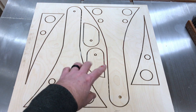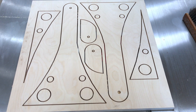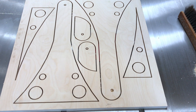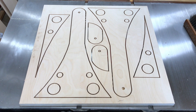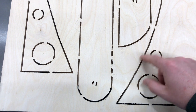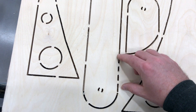I have my initial CNC cutout done. I need to flip it over and take it off, and I'm going to use the width of these pieces to precisely set my fence for the other two arms. When you use a wood CNC and it cuts out shapes, it leaves small tabs to keep the piece from moving around and messing up the blade or the cut.